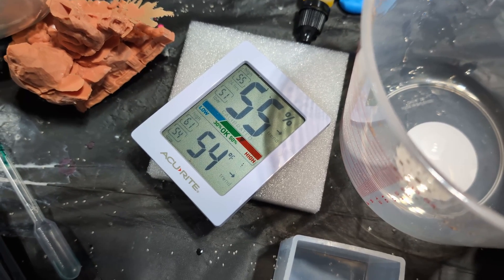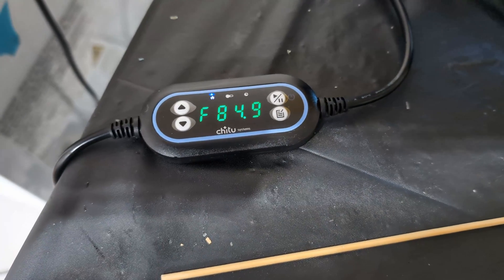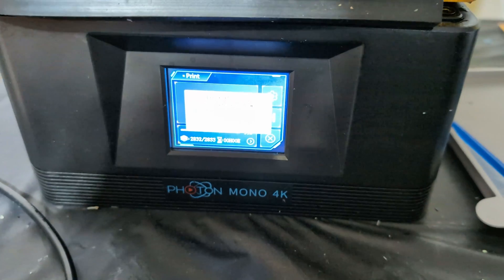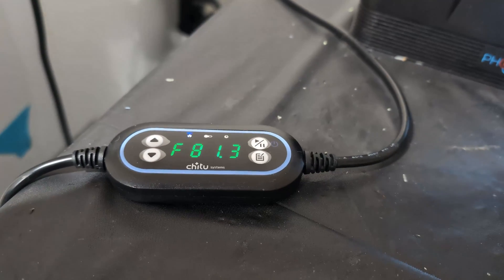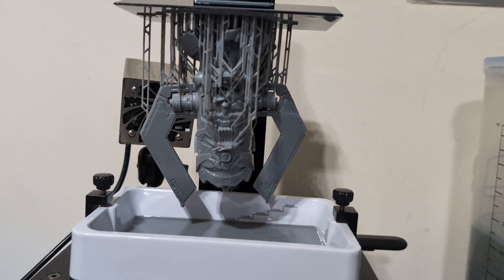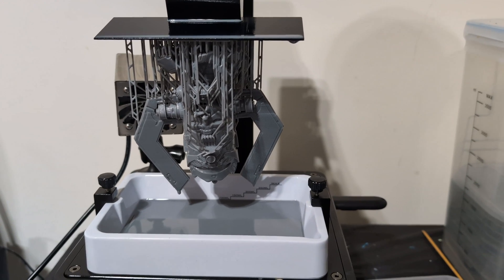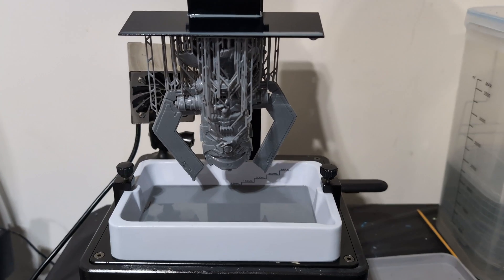It's now 54 degrees inside this garage and this print finished at some point during the night. The control panel is still holding it pretty much at 85 degrees on the inside. This took seven hours and 51 minutes to print — about eight hours — and the temperature held steady. As soon as I took the lid off, you can see the heat escaping as it tries to bring the temperature back up. So I'm stopping it here. Taking a look, this is a Galactus. I see one tiny little failure point where the supports had separated, but as I said, this isn't a guarantee that everything will be perfect — things can still go wrong, but it keeps that chamber warm to increase your chances of success.